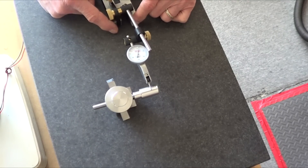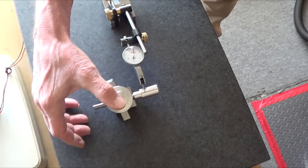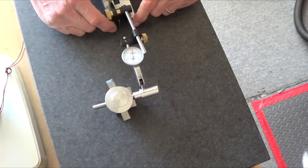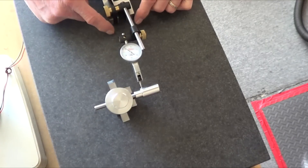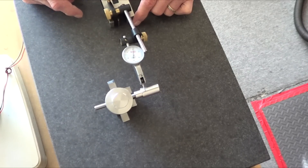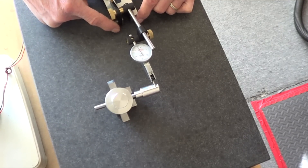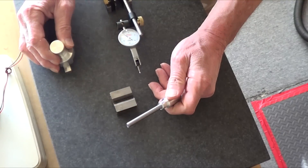The other thing I wanted to do is just see if I'm wobbling back here. You can touch and rotate it — I'll do it this way then. The peak right here is a half a thou somewhere around there. Rotate it ninety degrees, a hundred and eighty — just about on it. Very close to half a thou. So I am tapping it pretty much straight — centered or whatever. I'm within a thou here of being absolutely straight. Because this V-block is crooked.